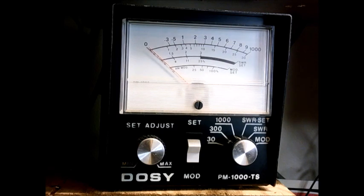That's the 811s in, at roughly 60 watts of input. We're getting 550 PEP, around 450 dead key. Which is about right — it'll go more if we drive it a little harder, but that's about exactly what it should be putting out.